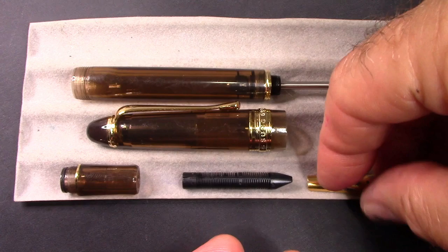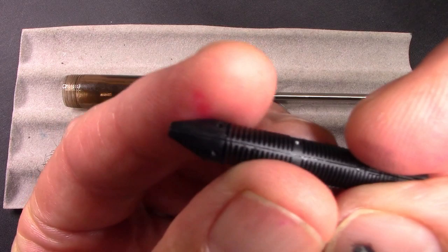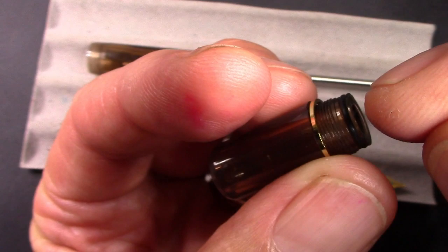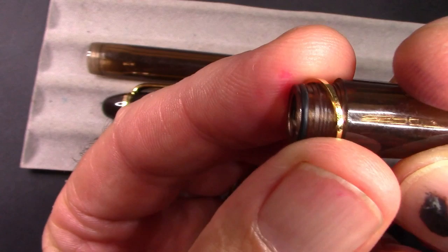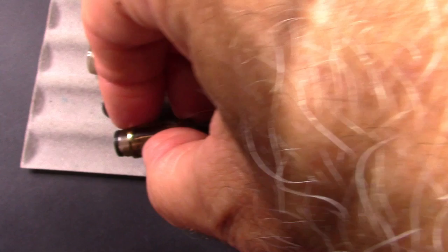The clip is fine, nice and stiff. We're going to look at the nib a little bit closer and compare it to the 626 nib. Here's your standard feed — just a groove on the back. Looking at this section, you'll notice right here is a little gate left over from injection molding that shouldn't really be there, especially when that vac fill piston comes down to seal. I'm going to definitely take that off before I reassemble the pen. There are no keys in there, so the nib goes in, and it's fairly thick — I like the fact that the section has some robustness to it.